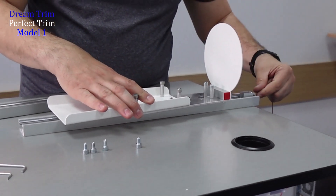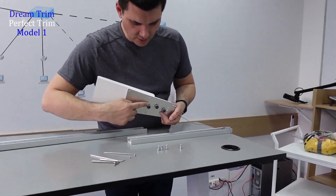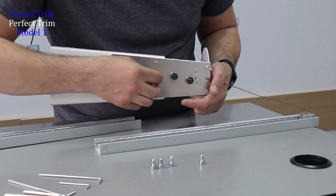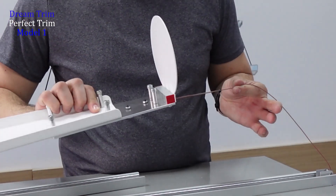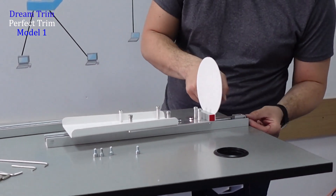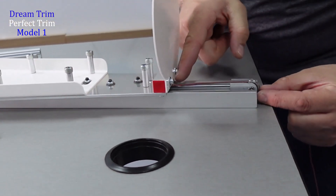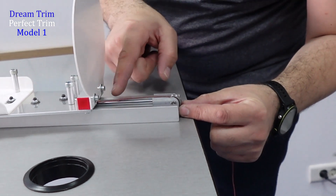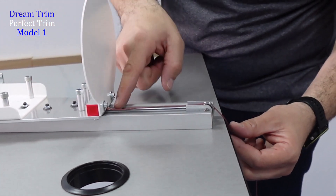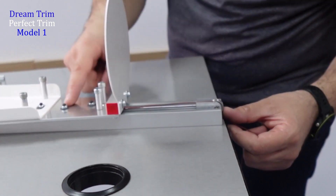Why is this a very high precision tool? Because of these rollers here, which are hardened steel rollers that roll on this hardened steel bar inside of the profile. These rollers and this profile are half of the manufacturing price of this instrument. Another very important thing is that this line from the attachment point to this pulley here is perfectly horizontal and should be aligned with the plate. Otherwise, it will introduce an angle — a cosine — into the force, and the measurement won't be so accurate.